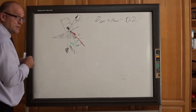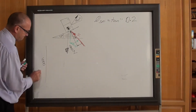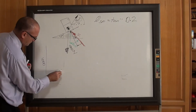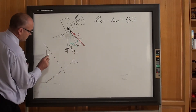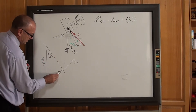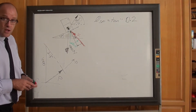A simple way is to draw it out graphically. 1000 down. That's 30 plus 10 is 40 degrees off the horizontal. That's your value of P. And that angle in there is 21.3 degrees. Draw it out to scale and measure off the value of P — don't do it mathematically.